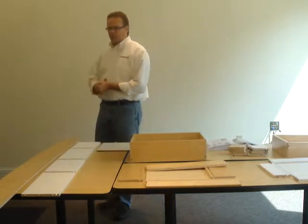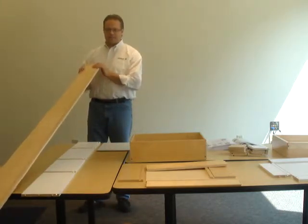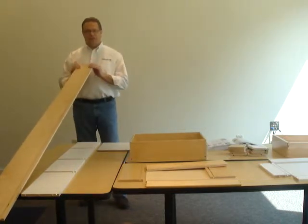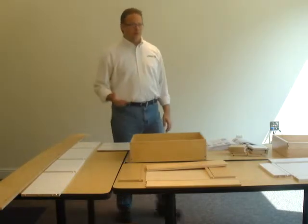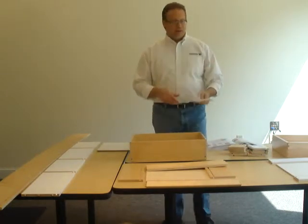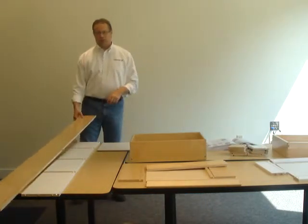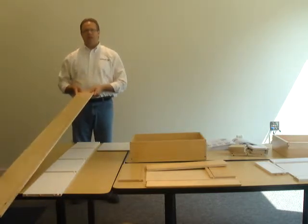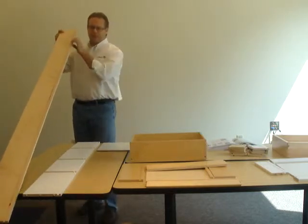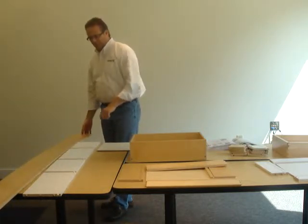One of the products that CH Briggs stocks in our Reading facility are 8-foot drawer blanks. These drawer blanks, like you see here, come in various widths from 2 inches up to 10 inches. They are available in Dura Wrap vinyl, like you see here, in black, almond, and white with a particle board center. They are available in Baltic birch plywood, or maple plywood, or solid wood. All the wood blanks have a UV coating on them to make them nice and finished. You'll also see in the blank, there's a 1/4-inch groove that runs down the length of the blank for you to insert the bottom of the drawer.